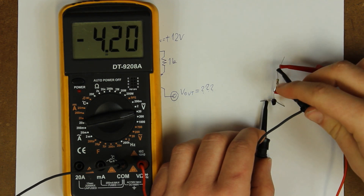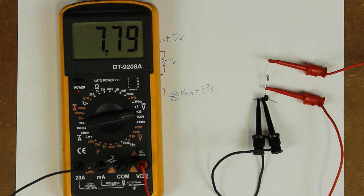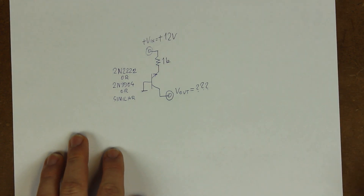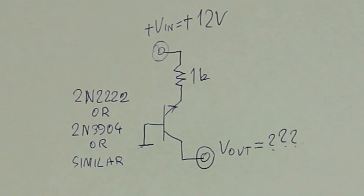But how does that translate to the negative voltage we get? Well, and this is the fun part: under breakdown, the junction starts to emit light, just like an LED — almost like an LED, a very, very crappy LED. This light then goes through the silicon lattice itself and makes the base-collector junction act like a photodiode. That's what we're measuring: a poorly lit photodiode. The fact that the light traverses through the silicon itself is why it works even in a plastic encapsulated transistor.